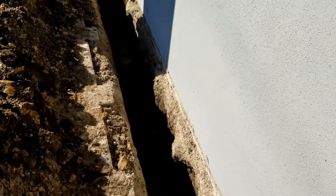So we're just about ready to go ahead and start cleaning this off. We've got all the gravel removed. You can kind of see what happens on a pour of a footer — you see this major overpour right here. And they actually did seal it right here, they sealed where the stucco meets the footer. Right here there is a four-inch block and it's solid stone, solid block. Above my hand begins the hollow block, so this is the actual wall. The floor is right there at that level. We want to make sure we seal above the floor — we're going to be way up here when we put our sealing on to make sure that stucco is not letting that water get inside.